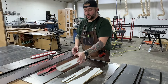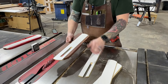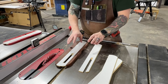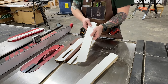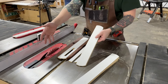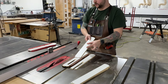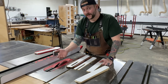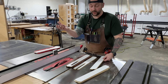We have our insert here. It comes with these two inserts. I don't know how to differentiate between insert and insert, but this is your throat plate and your insert. The throat plate comes with these two inserts, but he also sells these which are for dados. When you're running a dado blade, the riving knife doesn't do you any good, so you can raise the blade up through this and make a zero clearance for a dado. The issue is your riving knife is going to hit the bottom of this, so it's going to want to push the throat plate out of the saw.